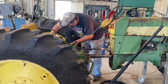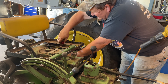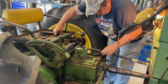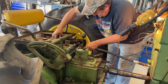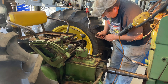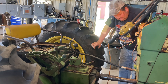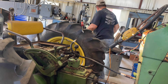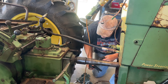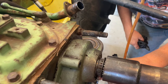I've got my hydraulic hose hung up right here. It looks like the outer covering is cracked and split. Let me grab some gloves. I believe this is the seal right here that is causing me issues - right here, this input shaft seal. Either that or I have a leak somewhere.